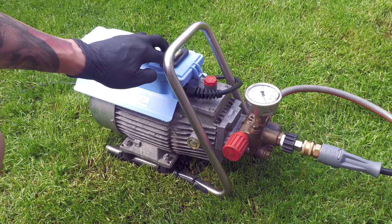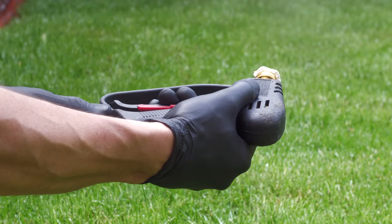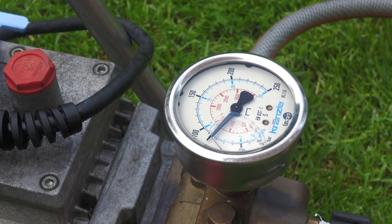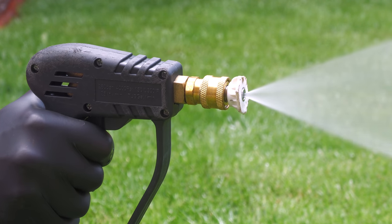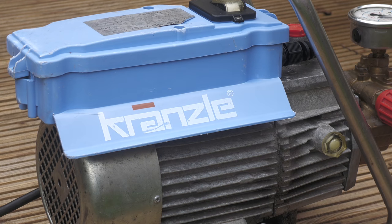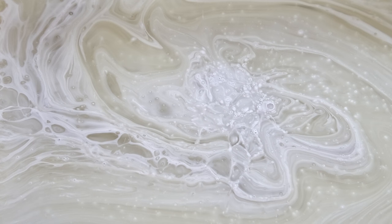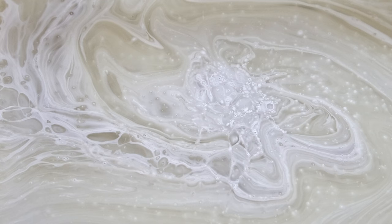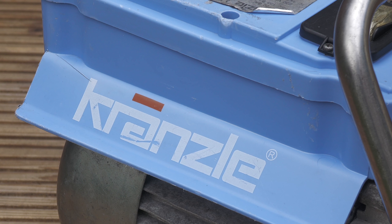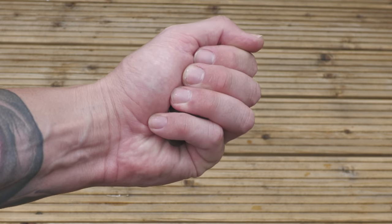With that done, all that was left was to hook it up to the hosepipe for a test run. Once primed through with the unit switched off to work any air out, I fired it up to check for leaks, noises, or vibrations — thankfully there didn't seem to be any — then gave the trigger a squeeze to check the pressure and needle movement, both of which seemed perfectly normal. So I concluded the self-service a bit of a success. While I obviously don't recommend letting yours go this long without any attention, it should be reassuring to know that these quality machines can still endure a fair bit of neglect — so as always, thanks for watching, see you in another eight years or so for an oil and seal change.